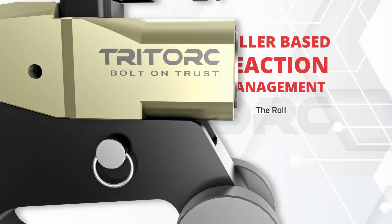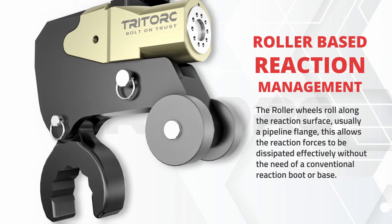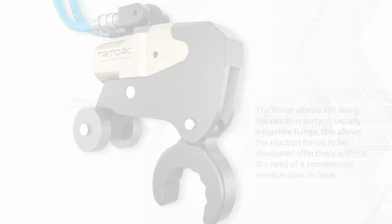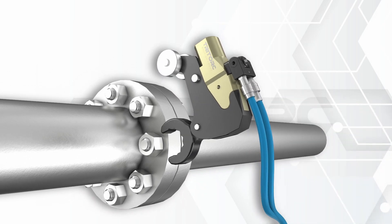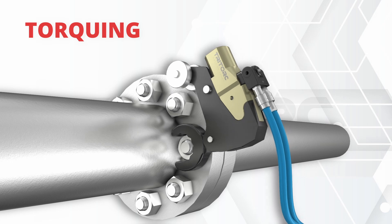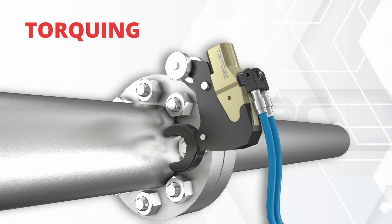The roller-based reaction point allows the tool to move along the flange blade and maximize the spanner's rotation of the nut. The THL series open jaw variant is shown here on a pipeline operation. The specialty of this wrench lies in its ability to access the nut in a constricted geometry — nut-to-body distance is the particular problem that this tool addresses.